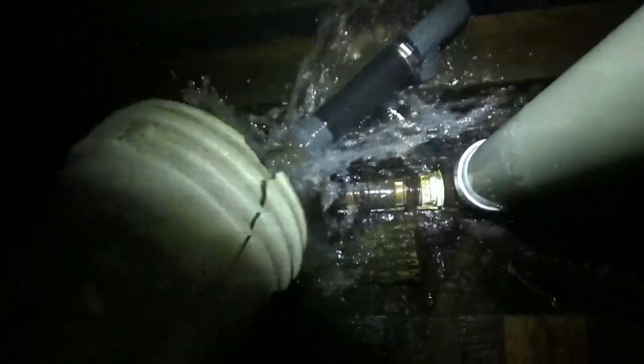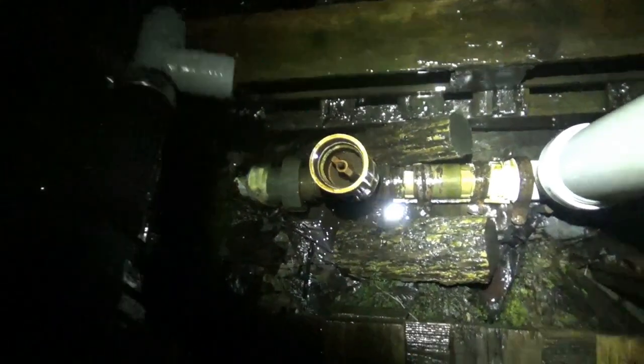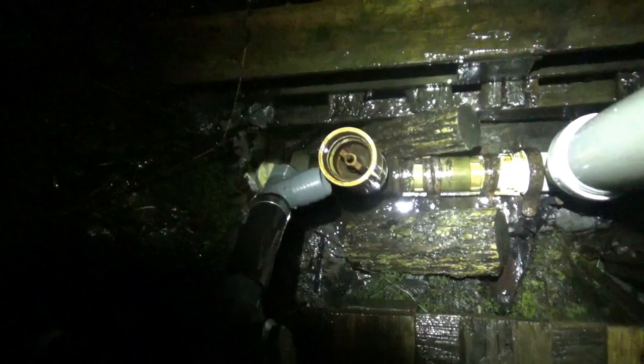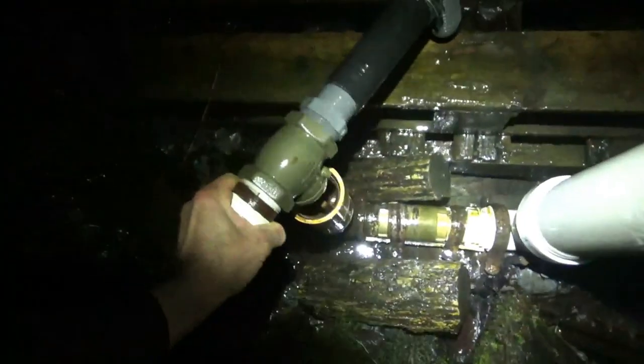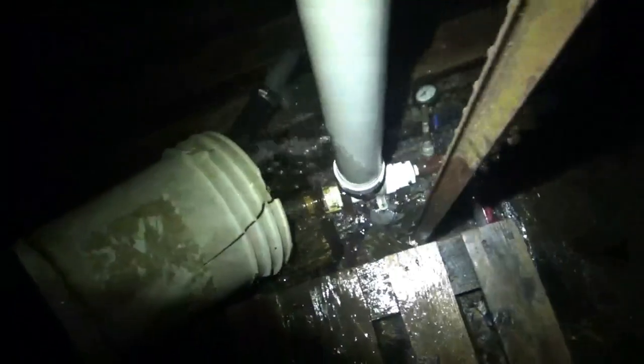Over here, the valve is set up — I just take a weight here because normally this will just close and your water won't come out there. That's not bad for weather that isn't super cold. But when the weather gets super cold, you want flow through absolutely everything, especially if this valve is brass like mine, or even worse if it's stainless — that is not a cheap valve to replace, so you don't want that freezing and breaking. What I do is I just take a little weight and pin it open. Because we don't have any pressure in the chamber, it doesn't try to keep kicking on and off, so it just flows. Everything's got flowing water above freezing over pretty much the entire pump, and I take a bucket and direct it so it hits as much of the pump as possible.